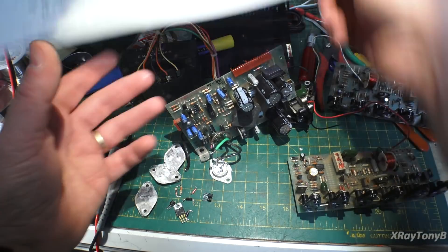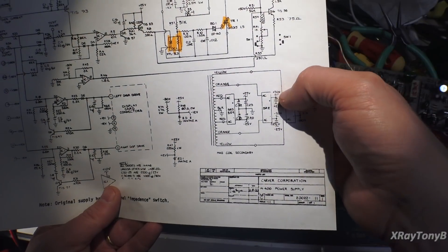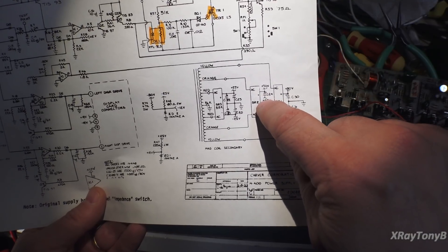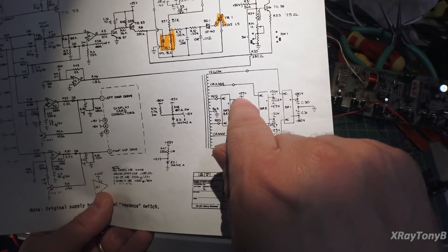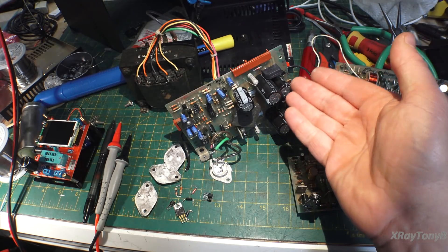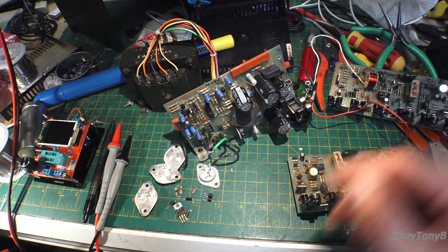You have to look at the schematic to understand what's going on. There is not 50 volts of potential across the capacitor, but there is 50 volts potential here. The negative part of the capacitor goes to the top of the 25 volt rail, so it's only handling half of the voltage. Kind of innovative how they did that — it is kind of neat.